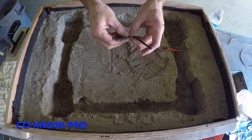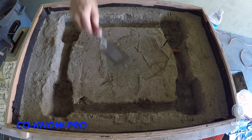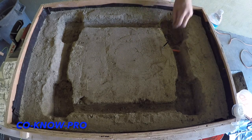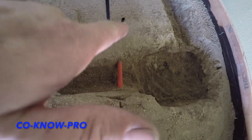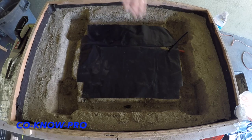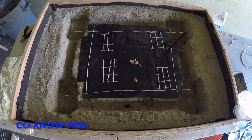Now we're going to insert our little drainage pipe into the sleeve that goes through the footing. You want to make sure you wrap any section that's in contact with the concrete with foam, and then seal your sleeve so concrete and dirt can't get in. Make sure everything is compacted properly — you might have to do a soil samples test — and also make sure you have your vent and your drain. Then you lay down some base with three-quarter inch gravel, and then you lay down your moisture barrier, which is right there.